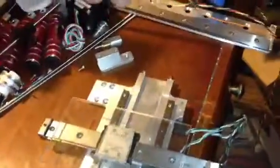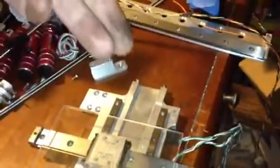And then, of course, I'm going to use this set of screws over here to bring a piece of T-slot up and at an angle and bring it angled over into the center here to hold the extruder, and then I'm going to move the extruder up and down for Z and leave this Y table on the table, the XY table on the table, and then that way this kind of arm that's going to hold the extruder and go up and down can be detached for travel when you store it.